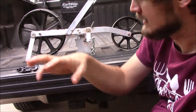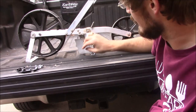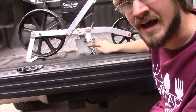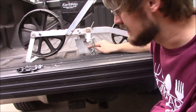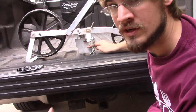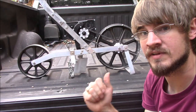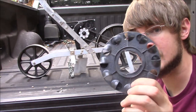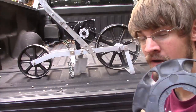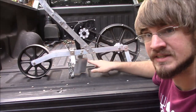The next thing we need to do is adjust our planting depth. The way you do that is with this plow-looking edge — there's a wing nut here and marks on the side with different numbers of inches, telling you how many inches deep this will plow your row to place the seeds. Once you've got everything adjusted — the correct seed plate, the spacing by blocking or unblocking holes, and the correct depth by adjusting the middle plow — you're ready to go.